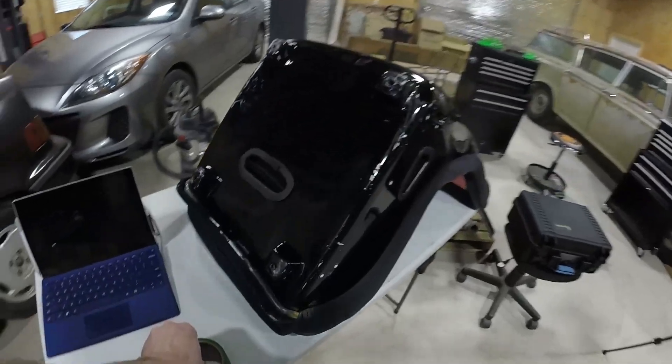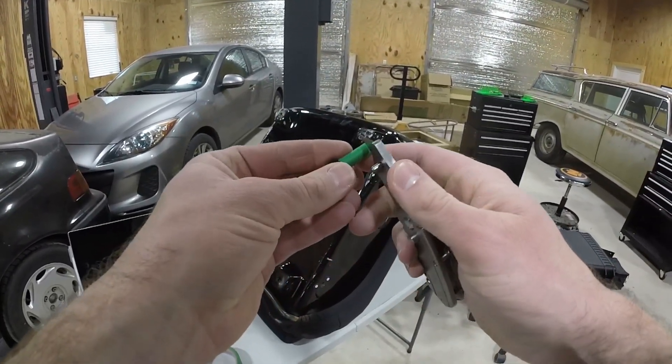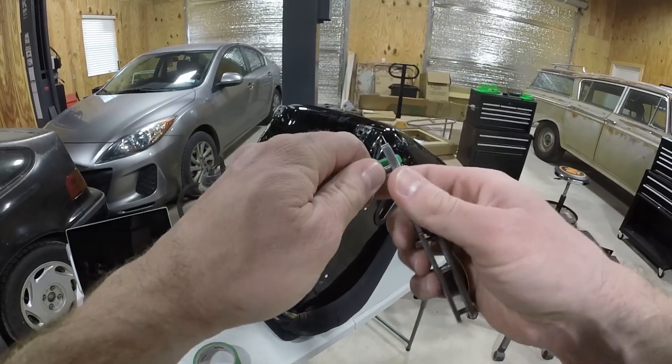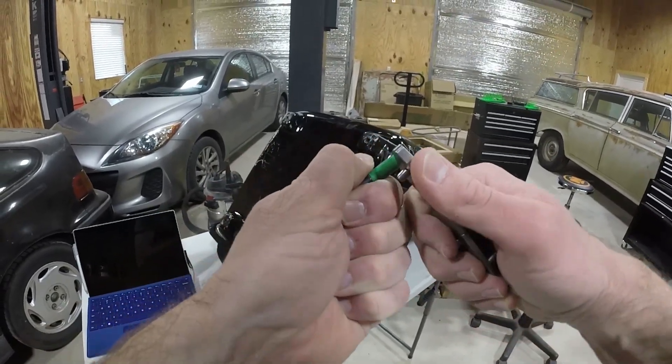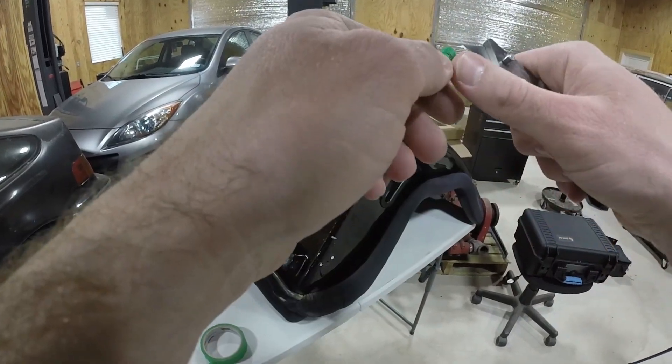I don't think last time I caught this on video, but this is basically what I did. I wrapped the bolt in tape, then I take some kind of cutting tool and safely remove the tape, cut along one of the threads, and then just pick it out of there — just like that.